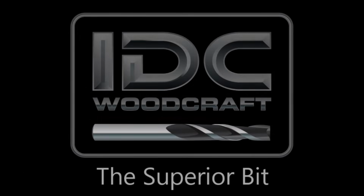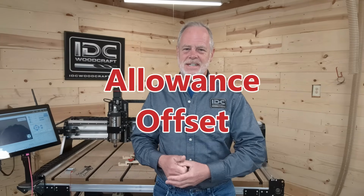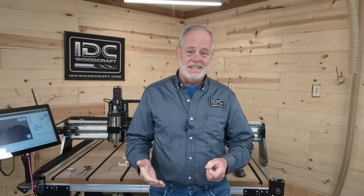Technique number 1, the allowance offset. This is the fastest and easiest way to offset a router bit from a line. In the world of CNC machining, we are offsetting tools all the time for a rough cut, and then we come in for a finish cut.